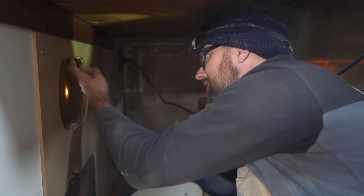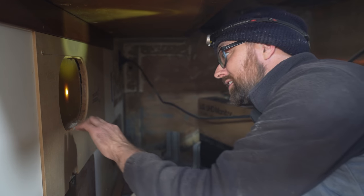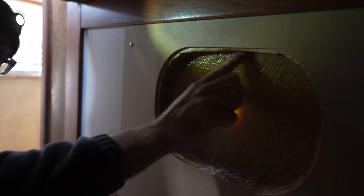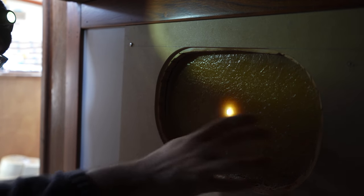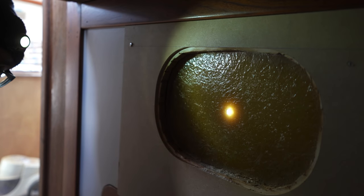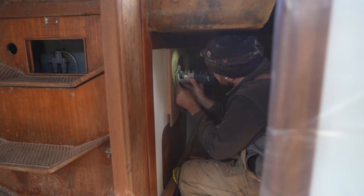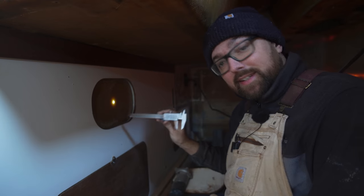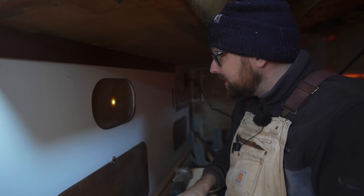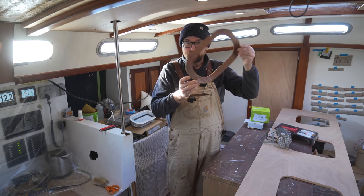First surprise of the week: the air gap in here is not as big as I thought it was going to be. I can barely get my finger in there. I thought it was going to be bigger based on the air gap down by the shore power connection, but yeah, there's not much of a gap here. I drilled a hole to check the thickness of the laminate, and the laminate plus the plywood plus the tiny air gap is still bigger than the port light would be able to accommodate, so I have to do this. But my flush trimming bit doesn't fit because there's a smaller air gap than I thought, so I have to beef up my template. The good thing about already having made a template is that I have a template for my next template. I then used the beefier template in the aft cabin to create a neat looking hole. The very last thing I did with this yesterday was to fill the gap here with thickened epoxy - between here and up here it's not a uniform gap, it's about five millimeters bigger up here. I don't want that unevenness to show up on the inside of the boat.